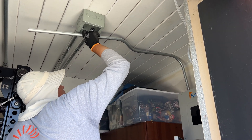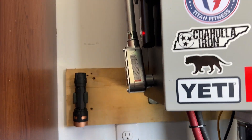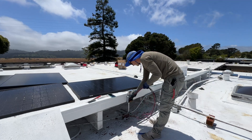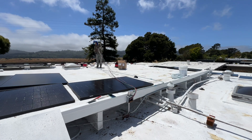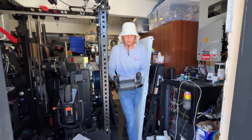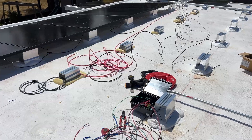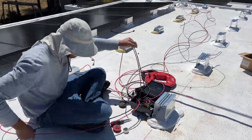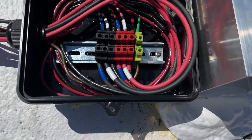Here's the conduit work. We have the SolarK 15K installed in the garage — it's installed without a gutter box, so we drilled the bottom side of the inverter and installed three-quarter inch LB and EMT conduit. We ran three pairs of 10-gauge THHN wires and one 10-gauge ground wire. After running all the wires we finished the junction box.